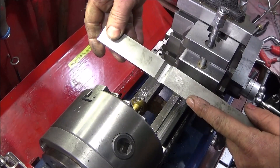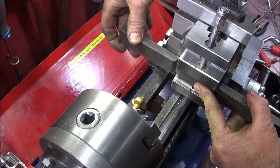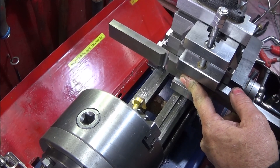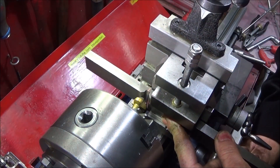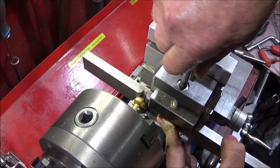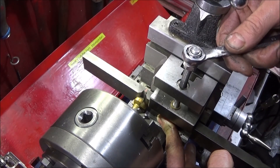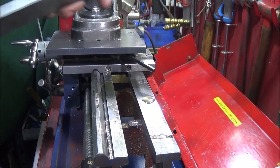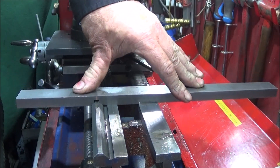To get that final cut I've got to put this back in exactly the same position. It's located on the back face — I've cleaned up the vice with an airline. So I'll push it up against the back face, position the cutter so the blades read the side, advance the carriage and it will actually self-center. Lock up the vice and then it's ready to go for that last cut. And now that's a perfect fit.